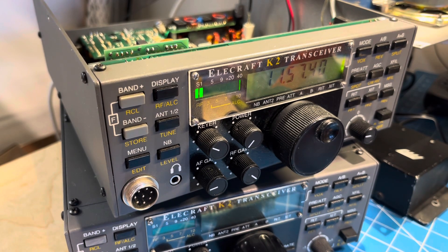Now we need to set the clock, and I have another video for that. There is one caveat: to prevent inadvertently changing your time, the K2 firmware requires a specific procedure. Turn off the K2, turn it back on, then tap Display. After a few seconds you'll see hours, minutes, and seconds, and then you can go through the set procedure. You can only do it right after a power-up. Find that other video, or drop a note in the comments and I'll check for it or add another one. Thanks for watching.